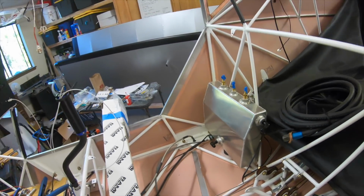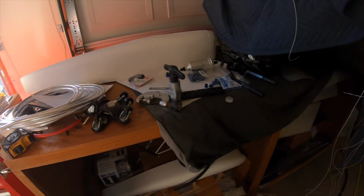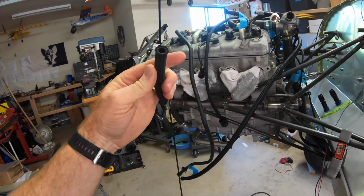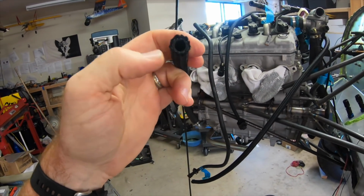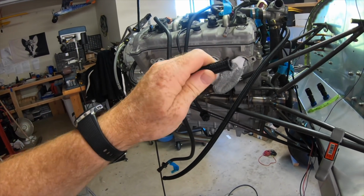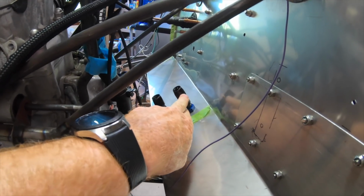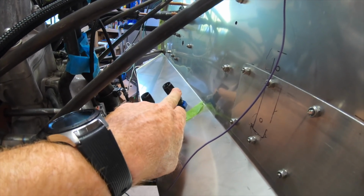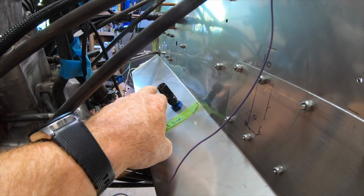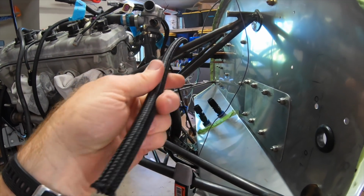So what I'm doing there is kind of a mix between the aluminum, and then the other stuff I'm going to use is an ethanol safe wrapped metal. There is metal braiding inside the rubber, so really strong, up to 1,000 psi strength fuel line, and it's going to connect through the bulkhead pass-throughs, which I already have in place here, with these style AN or -6 3/8 fuel line fittings. So a mandrel style connection to the hose, where you kind of screw it into the end of these, and it's a very secure high pressure line.